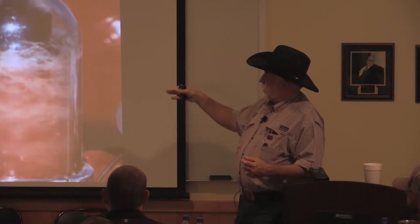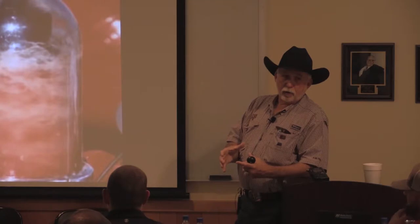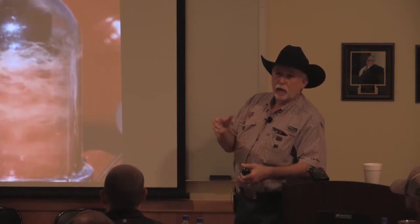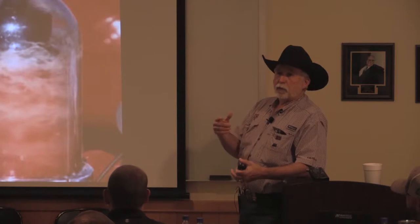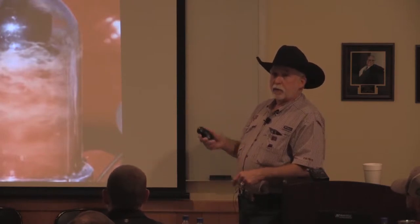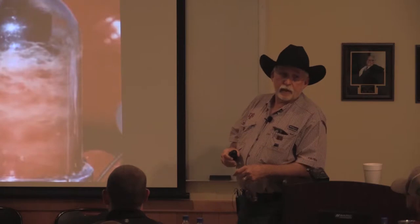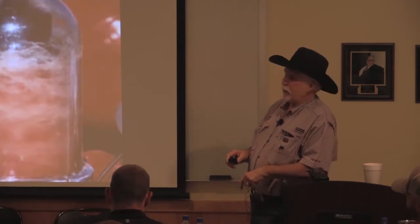That clean water, when it comes in, it hits that nozzle, and the hydraulic pressure is all operated under pressure. The pressure picks that cap up about a half inch, which releases those discs, and then those jets from the inside high pressure jet it and spin it, so we've got inertia and the jetting of the water to clean it. And the disc filter, for the most part, as soon as that disc starts to spin, and you can see that's pretty violent, 10 seconds. Once it starts to spin, 10 seconds and you're done.